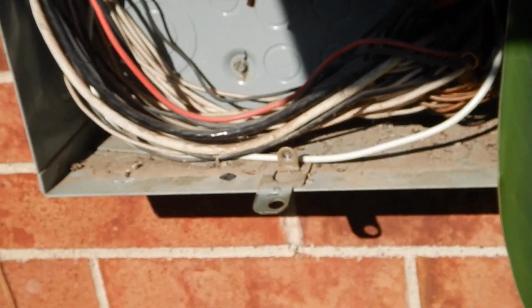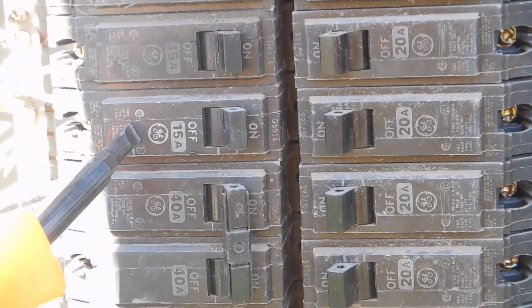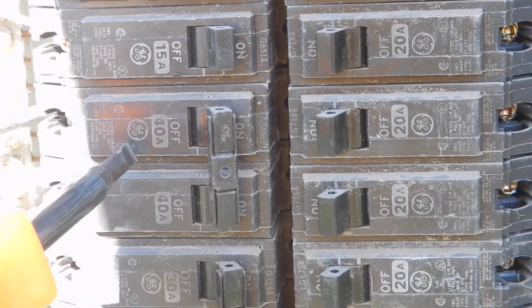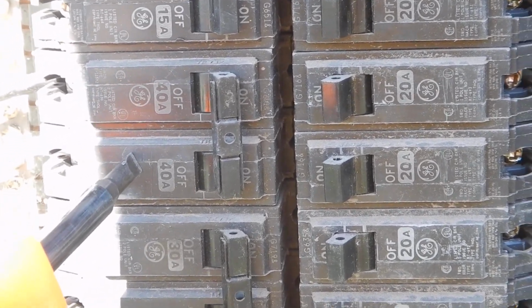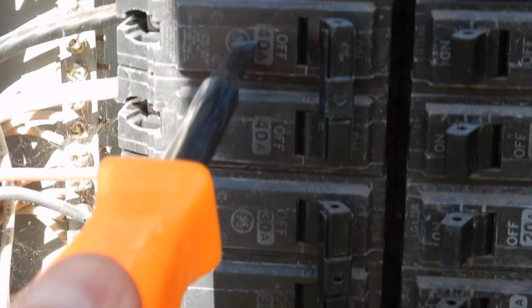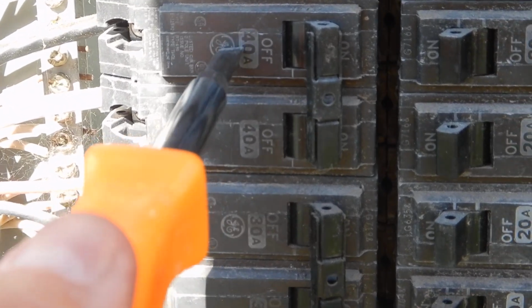What does it mean when the condensing unit is underfused? Well, it means that these fuses turn off at a certain amount of heat. It doesn't take a lot of heat to trip a 15 amp breaker. It saves you from the fire. It takes a little more for the condensing unit because it's big, 220. It's got a big job to do. So we got bigger breakers, bigger wires. It handles more power. But it turns off when it gets too hot. It gets too hot at 40 amps worth of heat. This condensing unit is designed to take 45 amps worth of heat.